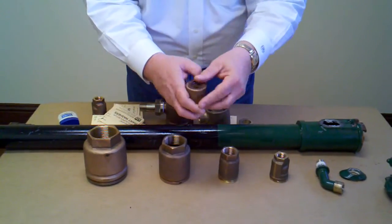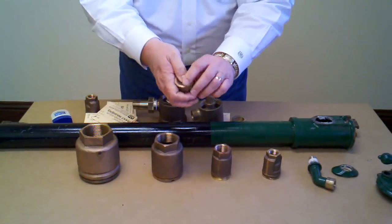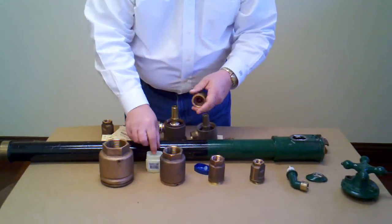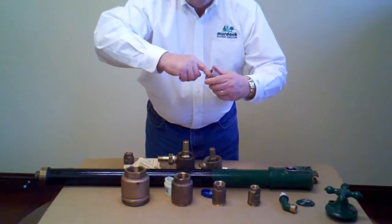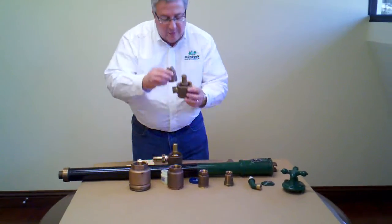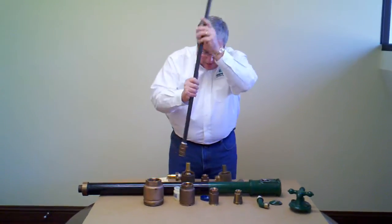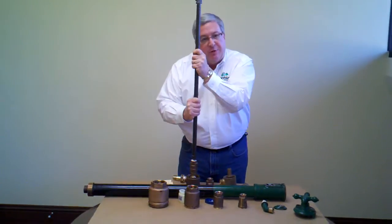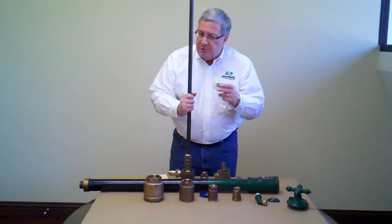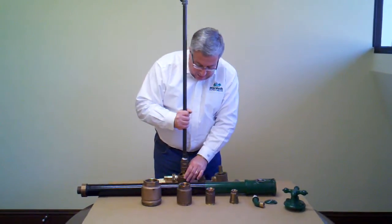Your ring washer goes in next the same way — just take it down nice and easy with your thumb all the way around. Then I recommend good old petroleum jelly. Take a little petroleum jelly and grease these washers up all the way around so that when you put it back together it'll slide up and down real easy on the valve stem. When you push the bottom connection back down into the hydrant it's going to have a real tight fit, so you want it to slip on smoothly. Use Vaseline or petroleum jelly — don't use duct butter, axle grease, or anything else.